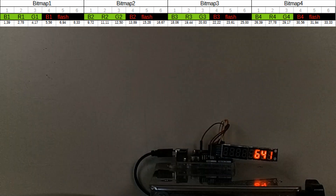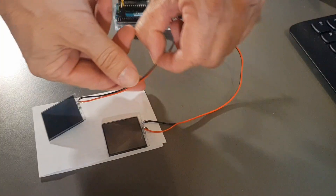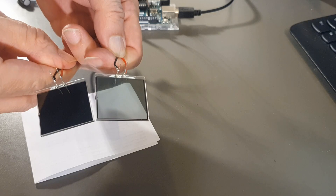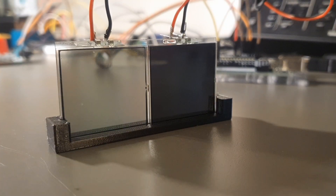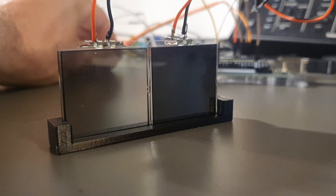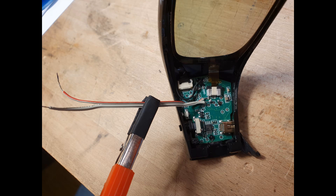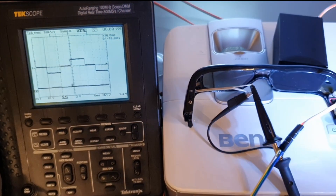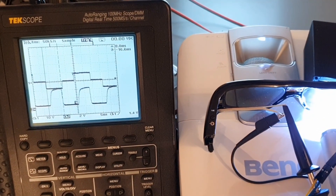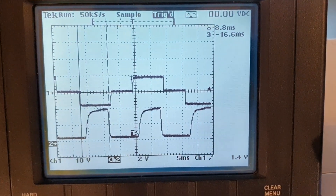To block out some frames from the projector stream, I decided to use LCD shutters. Think of them as a display with one large pixel that has a transparent and an opaque state — with the right timing, we can block or let through content. My first experiments were done with light valves sold as Arduino accessories, but they turned out to be just a bit too slow, with a maximum frequency of only around 10Hz. What we need is 120Hz. So I decided to use the shutter elements from old 3D glasses. To understand the drive signal during operation, I opened them and connected an oscilloscope. The shutter becomes opaque at plus and minus 9V, and transparent at 0V. How to control and synchronize the shutters with the projector will be explained later.